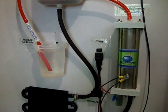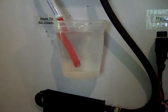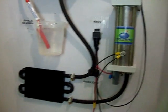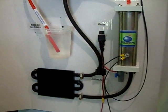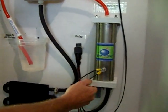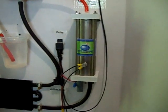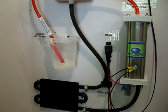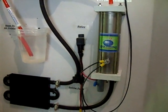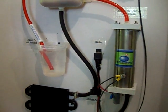Our main body on the unit is 3 inch diameter, quarter inch thick 316L pipe — it's pretty heavy duty. These are 3/4 inch polypropylene end caps, and inside there are 25 individual stainless steel electrodes which really help to produce the HHO gas.